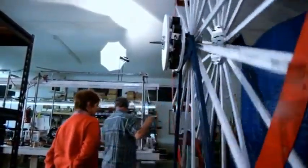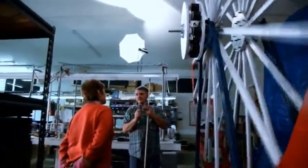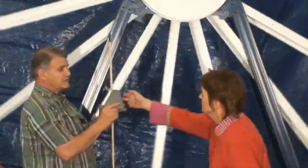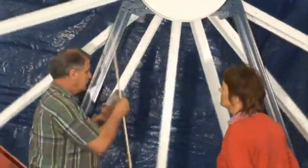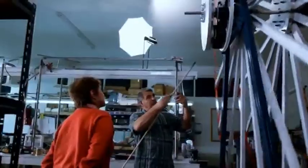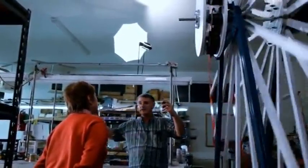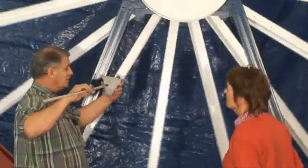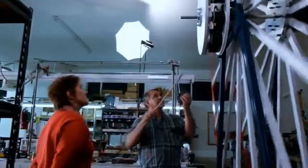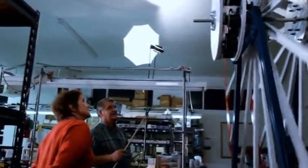The magnets are north in this direction and south in the other direction — north on this side. We're stationary in the wheel. We come by and hit the barium ferrite magnet with these poles in this arrangement. We hit this barium ferrite magnet and what we want to cause it to do is send a little signal in there and make the magnetic material inside flip poles. It does it really quick, and that's the shaking you see — it wants to turn around but it can't, so it just shakes.